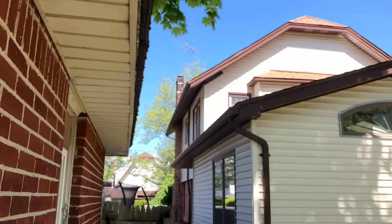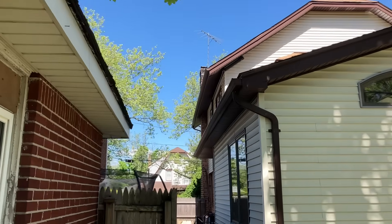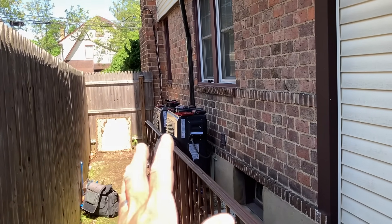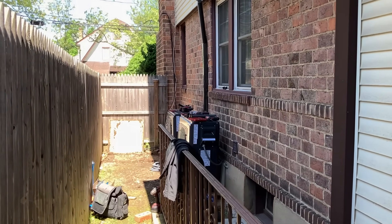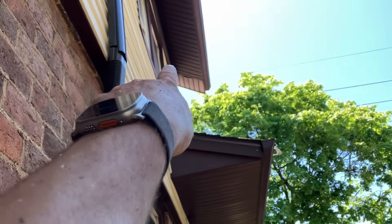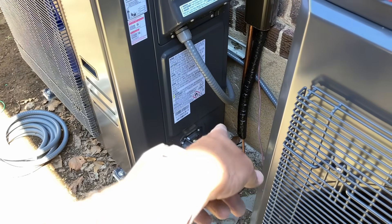All right, that's 11:25, we're cleaning up. See, that looks like it's been there forever. We have a length of extra 20-foot pipe here — we're going to use that for the first floor system when we're back next week. The homeowner had a difficult time taking two consecutive days off, so we arranged to install the outdoor equipment and run the line set for the second floor system while she's not home — no need for her to be home, we're not going to be inside the house. Everything worked out perfectly — we ran new line set from that corner, across and down, using that little piece of accordion, and we'll connect it to the condensing unit using the flaring tool next week.